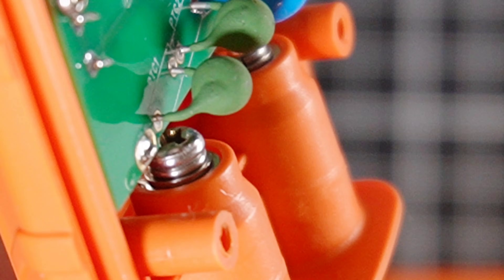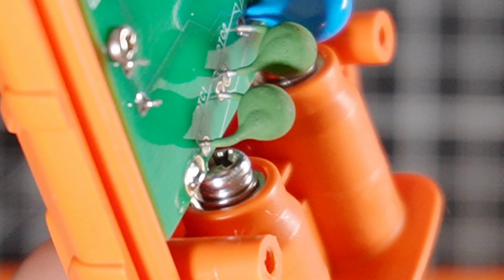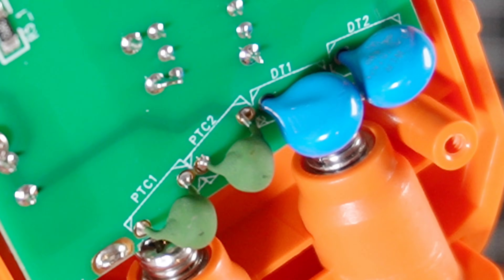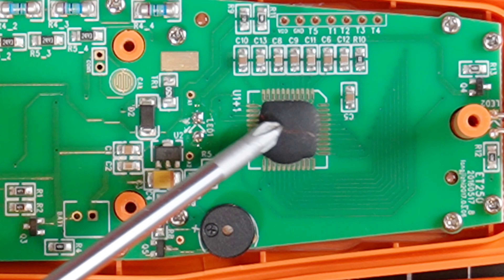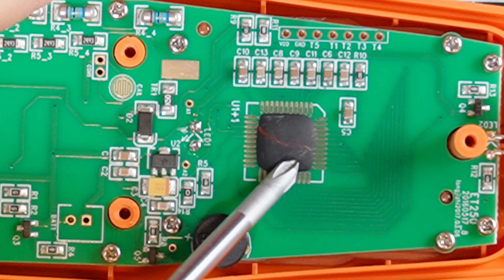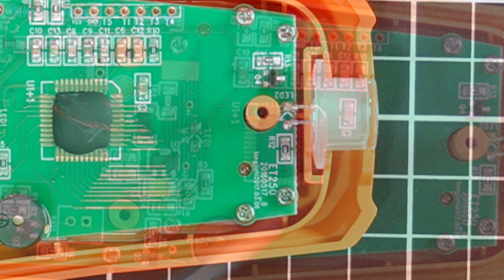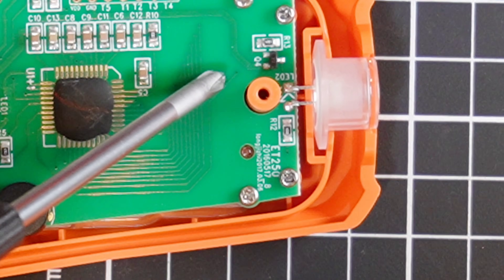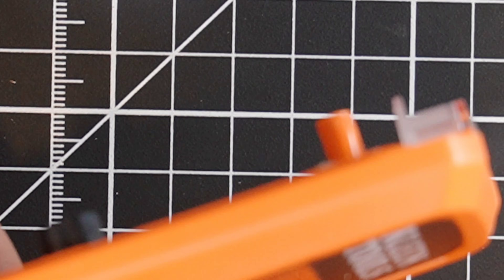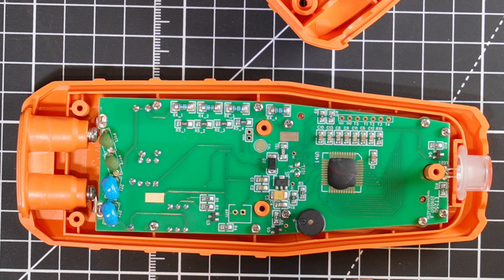When I see MOVs and PTCs, I get excited. Look at those inputs — they have been screwed on, not soldered, right at the connecting point. Long term, this is going to last basically a lifetime. No doubt this thing performed flawlessly on and off the bench. I am a little sad we don't have NCV — no non-contact voltage detection. We have room on that PCB, but for whatever reason Klein did not include non-contact voltage. It would have been such a nice thing.